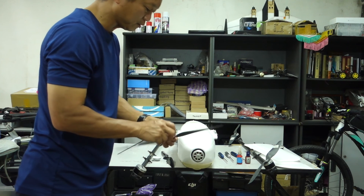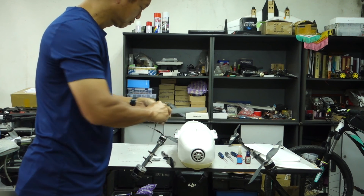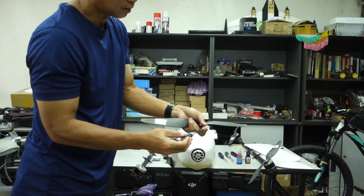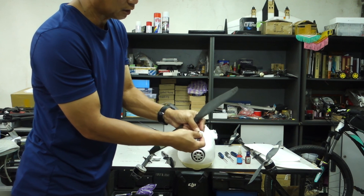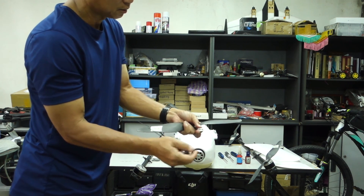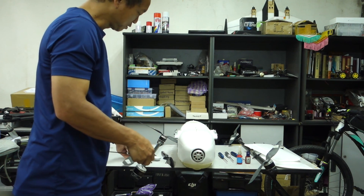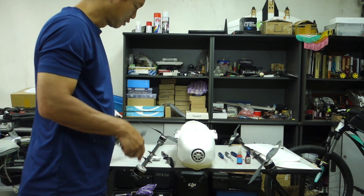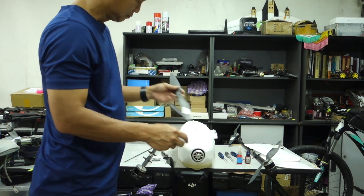You can lift it up. Here we have a spacer. This spacer has a seat here — a whole seat. So you don't want to put it the other way around, otherwise your bolt will be loosened. This side is the top. So do the same to dismantle the other four. Make sure you have labeled the propeller.